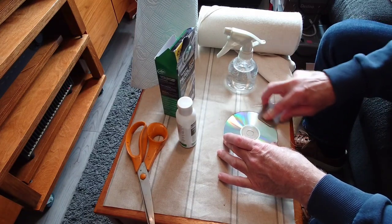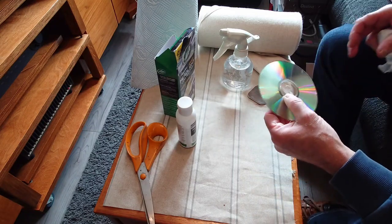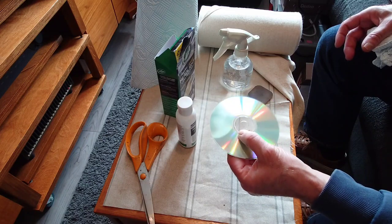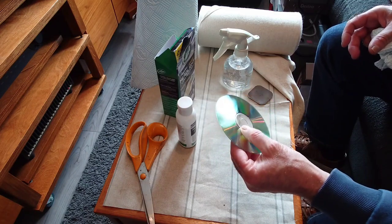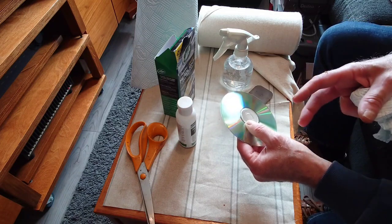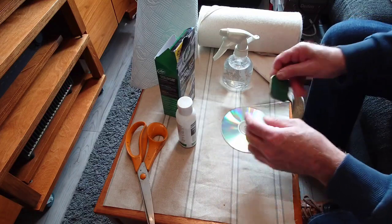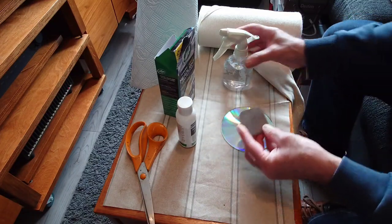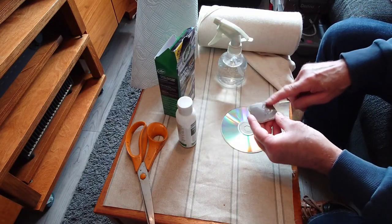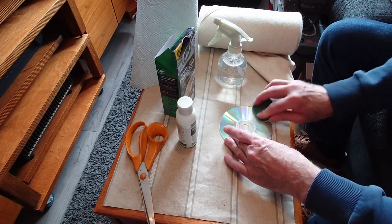Right, so I'll dry that off now. You can see it's got a hazy scratched effect on it. Now if you've got some very deep scratches you're going to have to work at it more to get those out. So now let's turn to the finer side — the idea is you're gradually scratching out the deeper scratches for finer scratches and gradually working it.